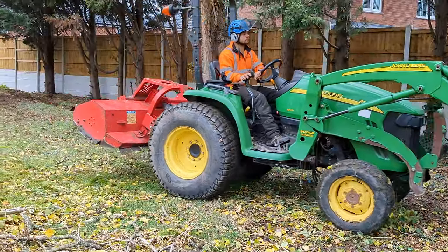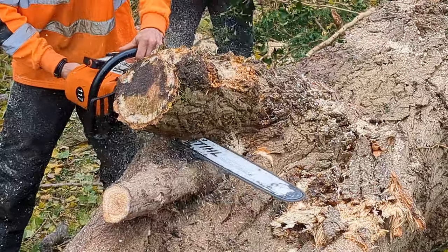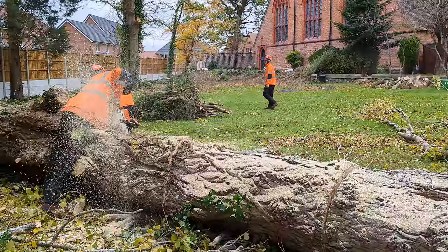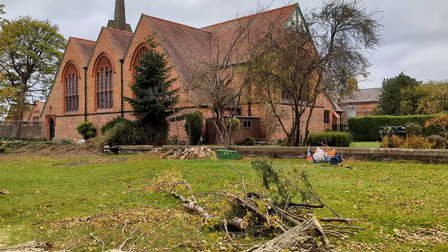If you're primarily felling and not logging, and you've felled a lot of trees throughout the day, then I think Hexa is great — it doesn't take a lot to get the edge back if it's not super dull. If you've been felling all morning and done a couple of tanks, just give it a tickle and it'll be fantastic again. Whereas if you're on a site clearance hitting bricks and things, it's probably not the best — you're really battering that chain and it's going to take a lot to bring it back.